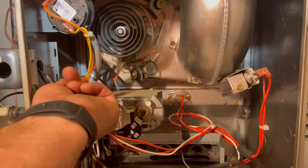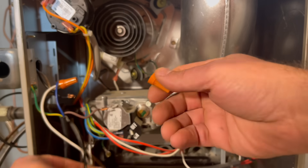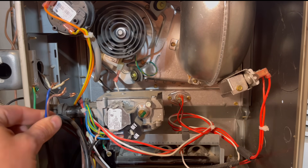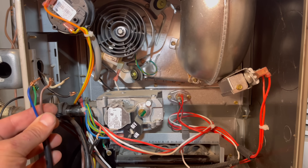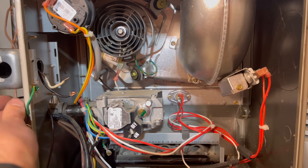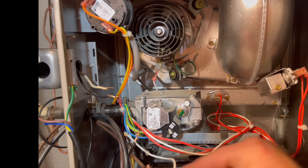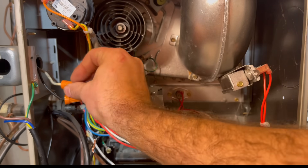We're going to show you — we're disconnecting here. Whoever wired this, there's supposed to be a box here and they did not put that in correctly. So all we have here — and don't be intimidated by the wiring, these are very simple. Once I get these disconnected, I'll show you what each is for. This is for the condensate pump. Normally it will have a blue, a brown, and a green. The brown wire is for your 120-volt supply and blue is for neutral. So if you have a 96% efficiency furnace, you definitely want to hook these up. Mine is an 80% furnace, so this is only used for the summer months — I'm just going to set this aside. Now these are the two main power wires for the furnace: just a black and a white wire. So 120 volts on the black and neutral on the white wire — these are the two wires that go to the furnace. We're just going to abandon these. You can put some wire nuts over these just to make sure that in case that switch gets bumped, nothing's going to happen.